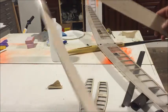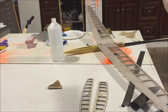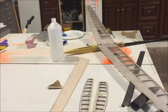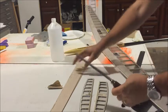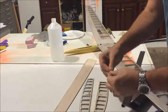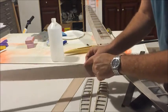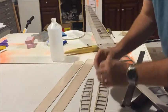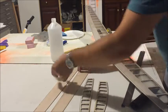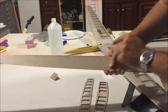When I cut this, I took the two pieces of flaps, overlapped them one on top of each other, and put them on the side of the wing. I marked the place where I need to do the cut-out. After marking, I took the zona saw, put them together, and cut it out. Then I took a piece of sandpaper, folded it in half like a sanding block, and used it to cut through to make the slot. I found one piece wasn't thick enough, so I added another piece in between to make it a little bit wider. This is done before you put the leading edge on.